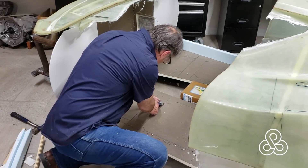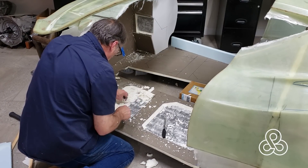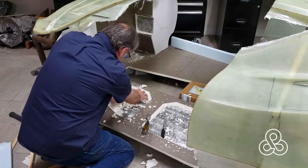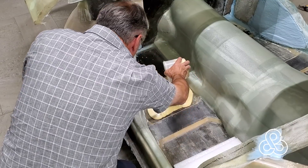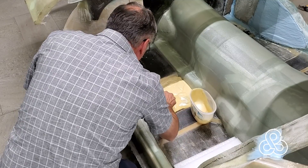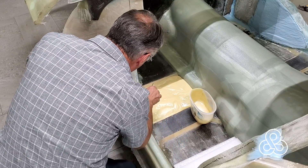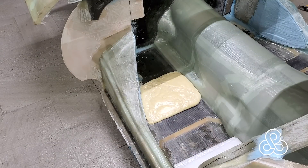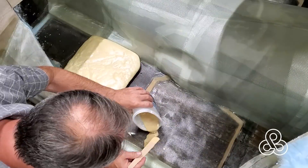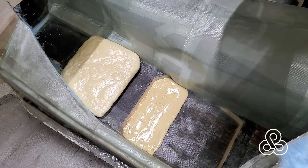Now in the floor of the tub, there are a couple of pockets or recesses that — if you remember — we created by cutting the foam out, or at least the craft paper off one side of our foam that we used to create that floor, and then gouged out all of the foam so that we can join the fiberglass through. So it would be bonded fiberglass to fiberglass in these recesses. Now I'm going to go back and fill those cavities. This is going to act like corrugated cardboard where three pieces of paper are kind of weak, but if the one inside creates a core, it creates a lot of strength. So we're going to fill this front recess completely full of foam, and then the next recess right behind it we're going to just partially fill because we want to keep the bottom — the part where the seat for the driver and passenger sits — a little bit lower to give us just a little more headroom. So we're going to fill those with foam and let those expand up.